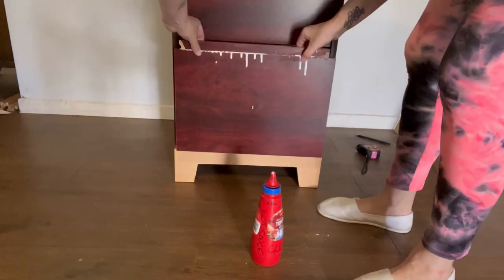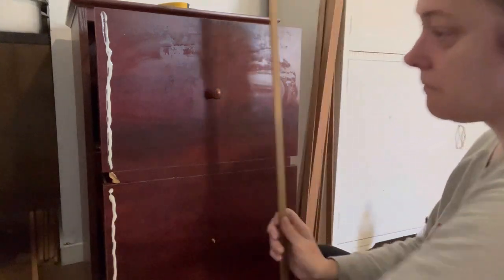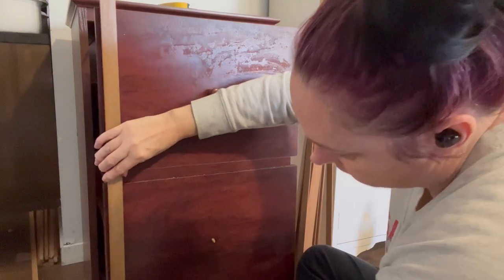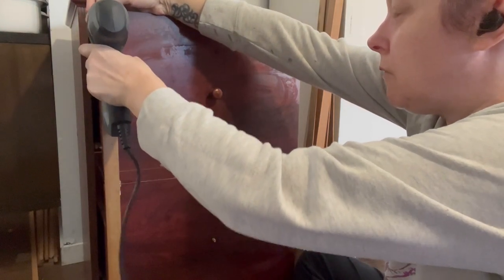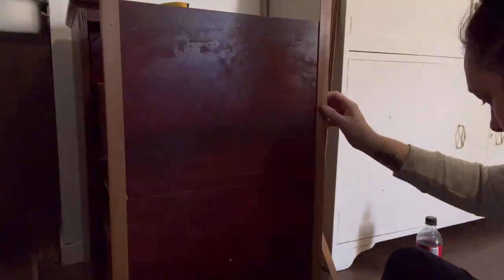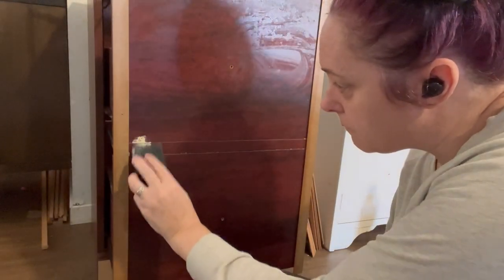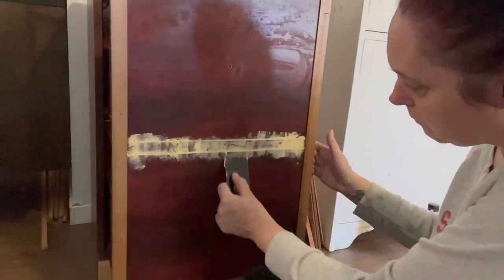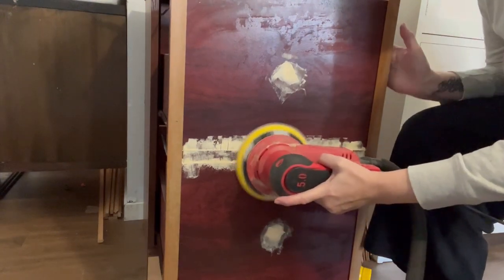There are gaps on either side, but don't worry about that. I'm using my trusty blind slats again and creating a pattern — kind of fluted, though that's not exactly the right word — across the front. I do mess up: the gaps aren't perfect. I was really worried and contemplated ripping it all apart, but no one has time for that and it's only for me. Once it was painted you couldn't even notice. Now I'm just going to fill the gaps where it's been joined, then once dry, sand and continue the pattern.